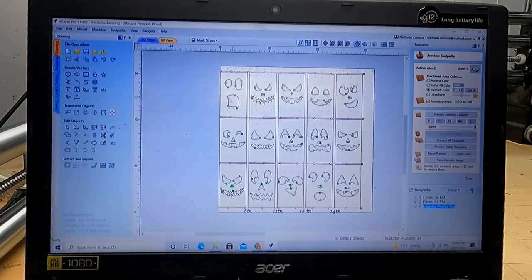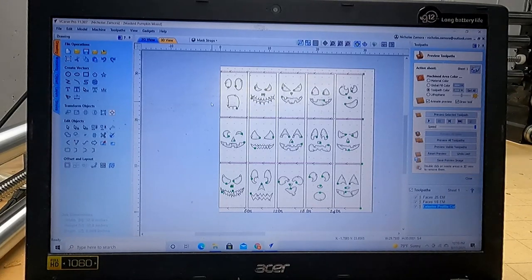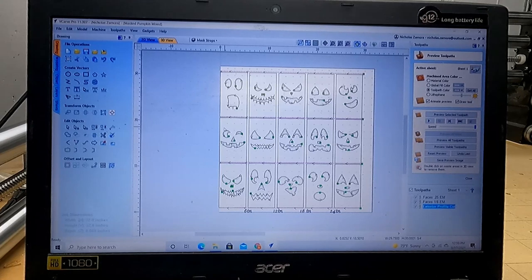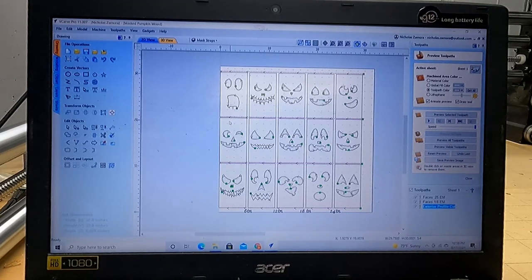But if you get these at 5 1/4, and then you try to put a 6-inch one on the side, and then a 5 1/4 on the other side, it's going to make it look like crap. So save the sixes for the tops, and then say you have extras. Well, then mill those down to 5 1/4 on your bandsaw or on your table saw, and you can still use them. So don't pass up the sixes. I do like those. I use them.